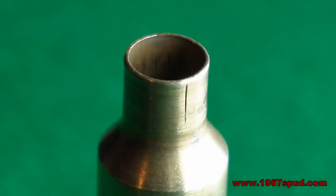The cause for this is being used several times. What would help alleviate this would be annealing. A classic example of the brass getting hard at the top of the neck through overuse, over stressing and splitting.